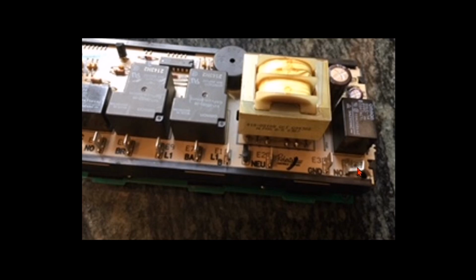I suspect that when you put this control board back in, you'll see how tight the wiring is and how easy it is to bend this. So pay attention to those, I think they're blue wires that were coming up to this connection here. Straighten this tab up and resolder it on the other side so you don't have a problem here. I'm sure this is not a one-off problem. This is clearly an assembly issue on the Thermador production line. So fix that while you're here.